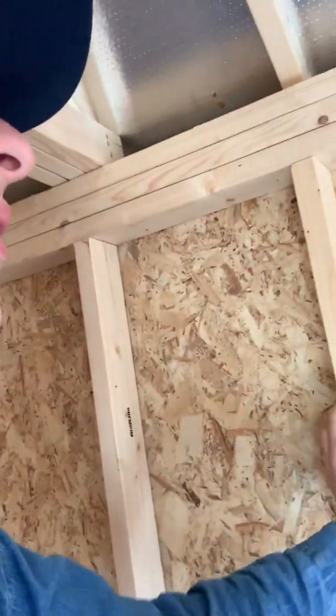This is a 12 by 20 shed. It has a little ridge line for some heat to get out, which makes a small difference but it's still really hot without fans. The cost of this shed delivered, with hurricane straps and cinder blocks, was five thousand dollars. I bought four 24-inch fans — we're going to have to cut the two-by-fours and reframe each one along this wall. Those were nine hundred and sixty dollars shipped from QC Supply.